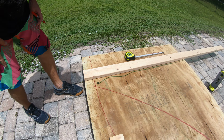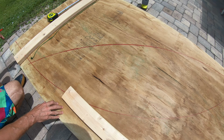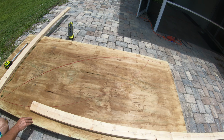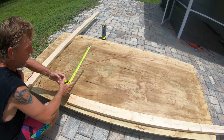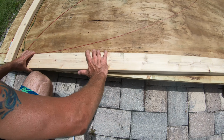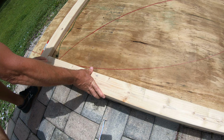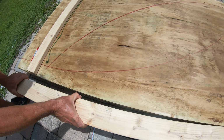So once you get your screw in and your string, take a pencil or a pen, and you can see in this video that I've already made our marks. The reason we're doing this too is because this is one side, this is one side, this is going to stand up and be on the ground. And a 2x4 is not 4 inches, it's 3.5. So you can see that right to there. You make it 3.5 right here so your 2x4, when it's on the ground, has nice support there, right?